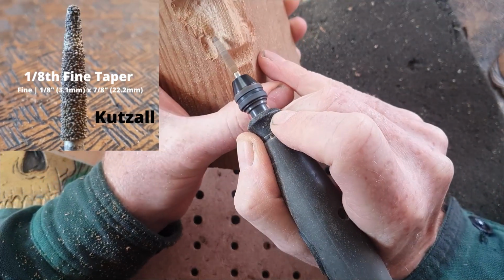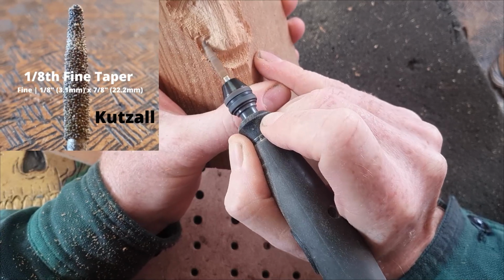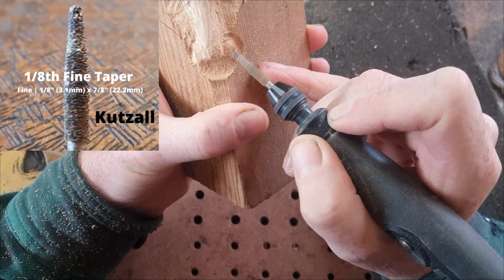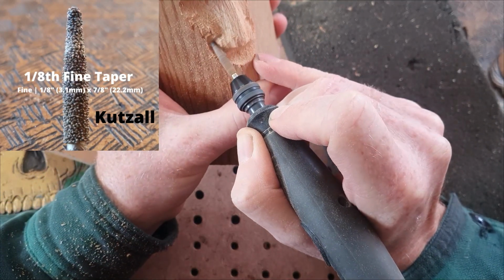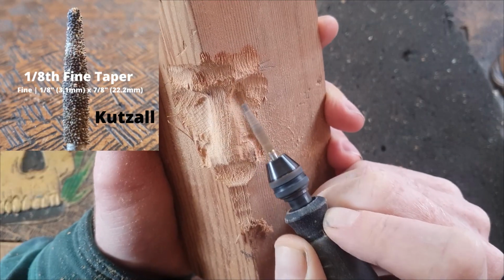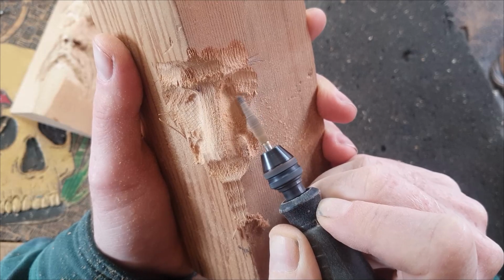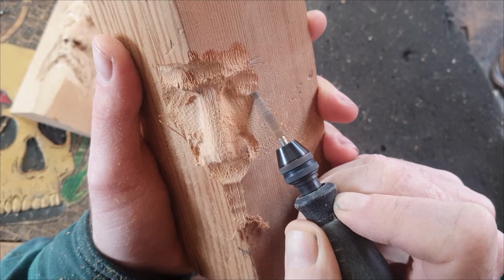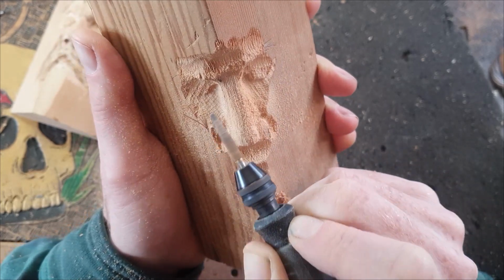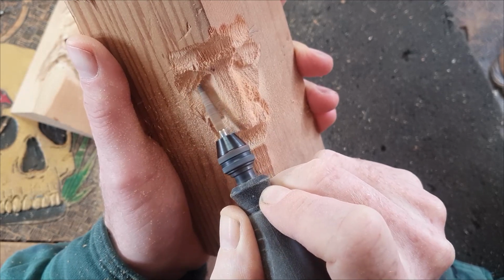Now if you ever find your burrs are burning the wood, you can use them with a lighter touch, or you can slow the Dremel down as well. This one is very good for those little details and sketching in shapes. You can see me here sketching in the shape of the eye. And if you want to see an eye carving, I will leave a link for it in the top right hand corner and also in the description on this video.